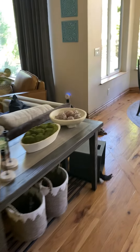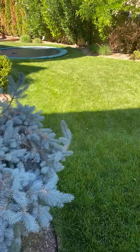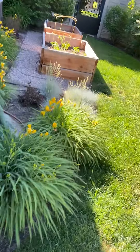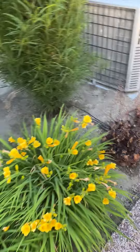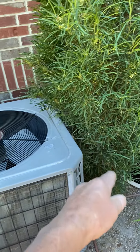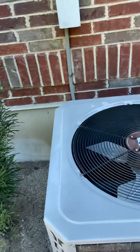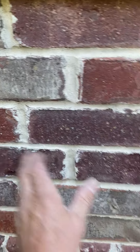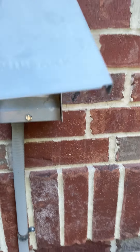The AC is on the west side of the house, and there's a basement entrance right there. The breaker panel is in the furnace room — it's on a 50-amp breaker right now. This condensing unit is in front of the disconnect and right next to this tree. We're going to use this disconnect as a junction box and run our conduit out here and add another disconnect over here.